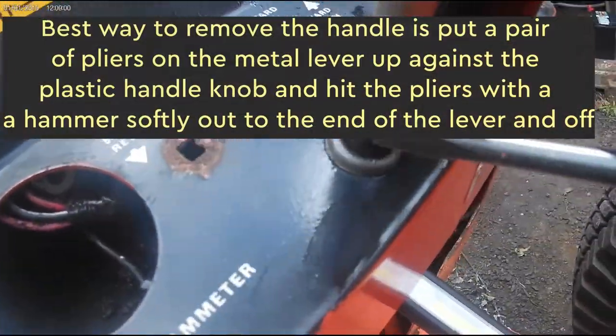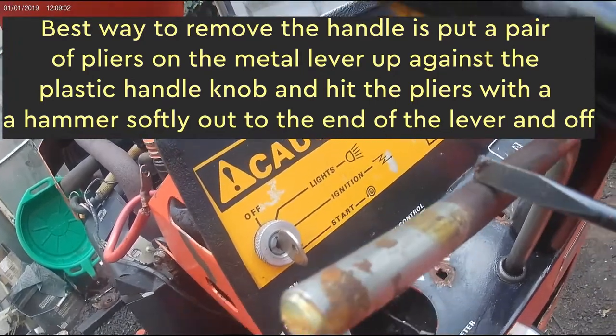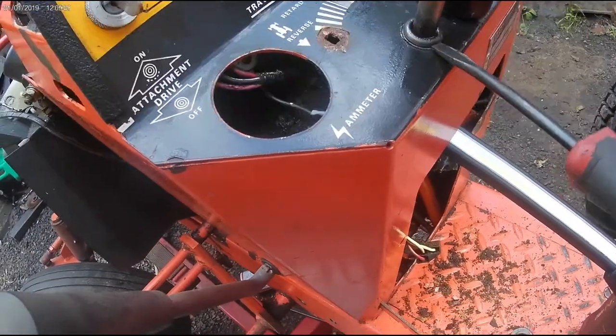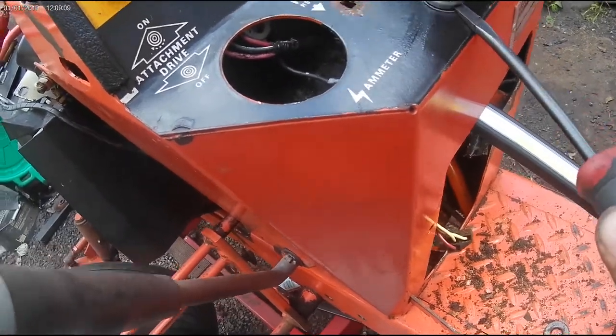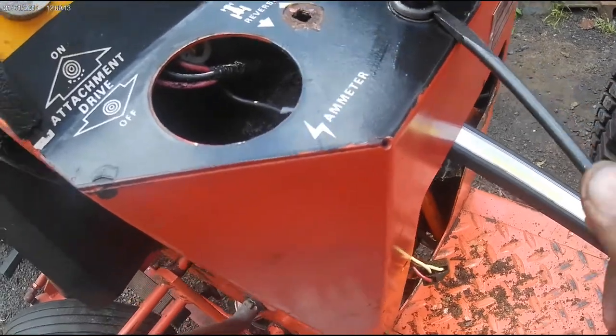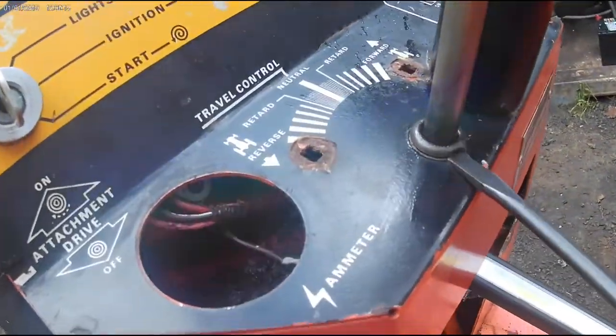As you can see, the roll pin is now removed. The handle is removed off of here. You want to clean this up a little bit. First, we need to get this old one out. Usually, you either cut them with a razor knife, pry them out with a screwdriver, whatever you've got to do. A pair of dykes sometimes. And work these out.